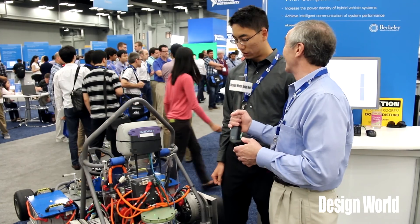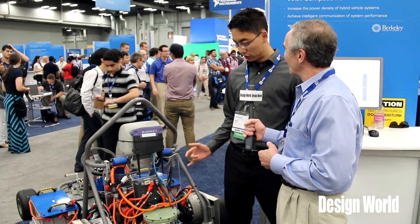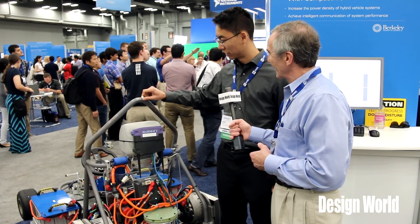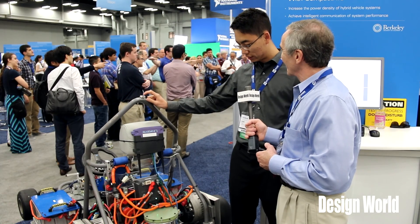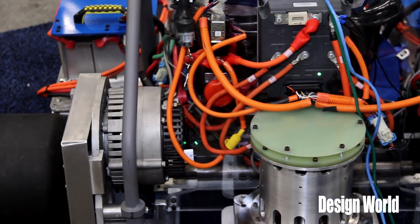This particular flywheel looks a lot like an electric motor. The flywheel is actually part of a custom motor that was built in-house. The flywheel is attached to the rotor of the motor, and the rotor also has the permanent magnets — shown here just for demonstration purposes. There's a total of 24 of these magnets, and the coils of the motor are in the stator of the flywheel.